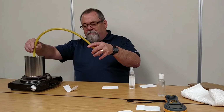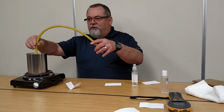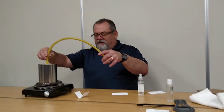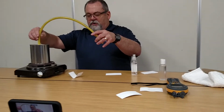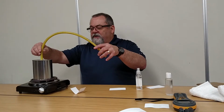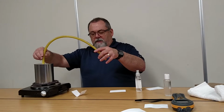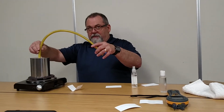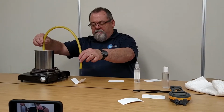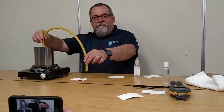Now, every time I do this, I burn my finger. I have no clue why, okay? I'm waiting for that vapor to come through this hose. Sure glad I started that as early as I did, okay? We're almost there. Because I want you to watch that card. Last time I spritzed water at it. No, this time I'm just putting vapor to it. That's all it takes is vapor. On day 1, and maybe even day 2. But once we correct the cupping, oh, there it is. Watch the card. What do you think? Okay?